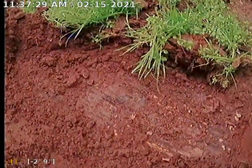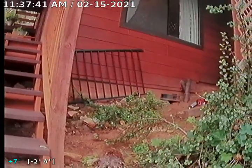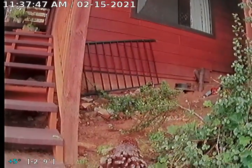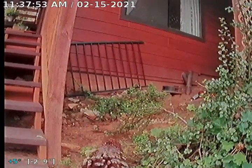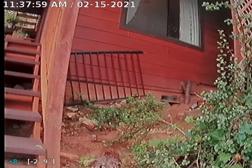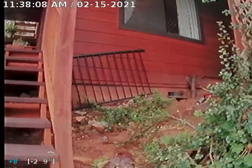That's already there for the septic, and the other people can start covering the rest to get down and pump the first and second tanks out. Everything is good on the system as far as the plastic drain and sewer line — it is all plastic, which is what you want, and it's all in good condition with no issues. The laundry does need to be modified: it's not currently dumping into this system, and there's an illegal gray water system pumping out to the side of the home. That needs to be routed back into the normal ABS plastic in the laundry room. Other than that, there are no issues with the drain or sewer system at this property — that concludes this recording.